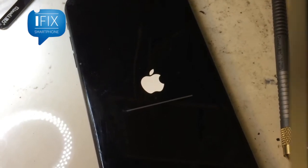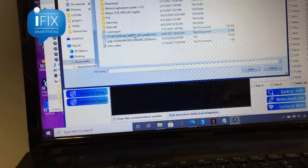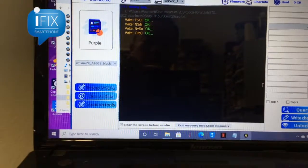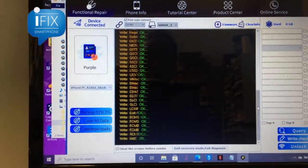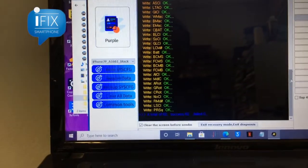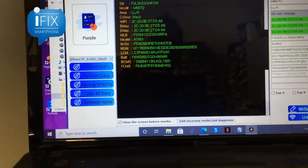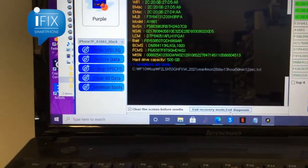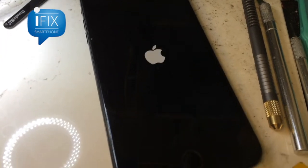The phone is restoring. Once the phone is restored you need to activate it, but since the values are not there yet, we use the IDFU box again to write back the system configuration onto the new board. Writing is done. I also check and write the unlock and WiFi as well to make it future-proof. Once you exit, the phone is going to reboot.